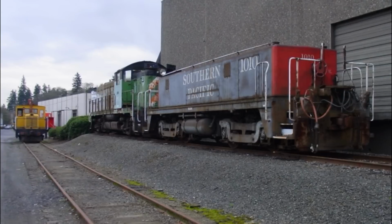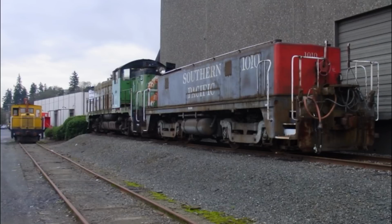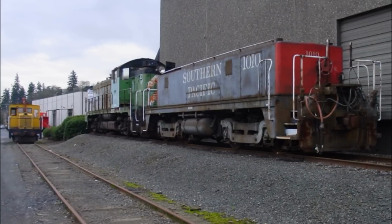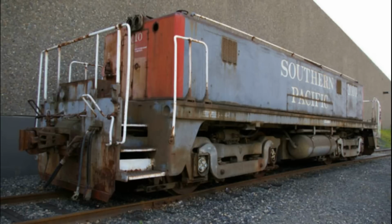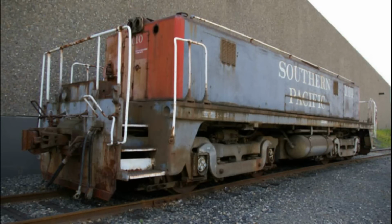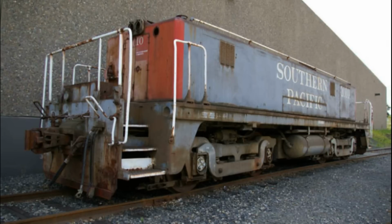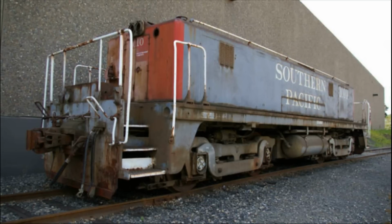Since slugs lack a prime mover, they typically carry ballast to increase their weight and improve their traction, often in the form of large bricks of concrete, and as a standalone unit can either be built brand new or converted from an older locomotive. The latter option is the one normally chosen, however, as it's a way to reuse obsolete locomotives, especially ones with worn-out prime movers.